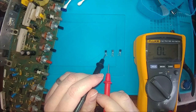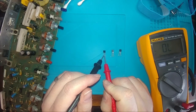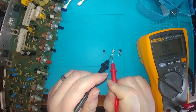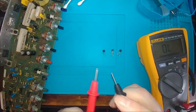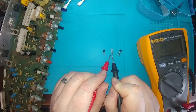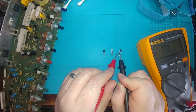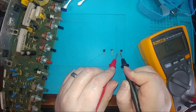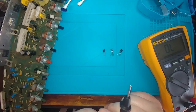So I'm going to put the negative lead to the emitter and check between here and base, and I should be fully open. And I am. Now when I reverse, 0.72, 0.71. Okay,